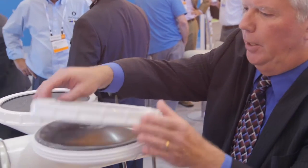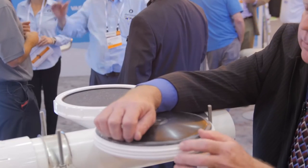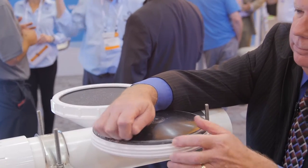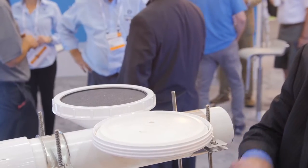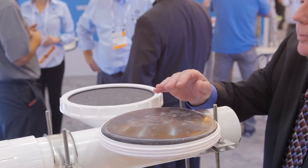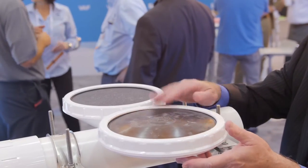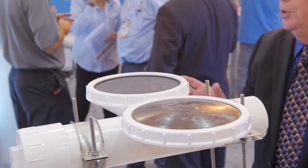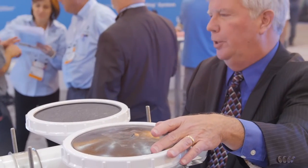When you're looking at opportunities for upgrading in a wastewater plant, if your plant has a conventional membrane in a 9 inch pod, you simply remove the existing membrane, replace with the new, and just that simply, you now improve the efficiency of your system by at least 5%. If you've got old membranes, probably something more in the order of 10%, if not more.